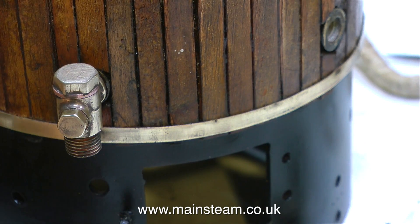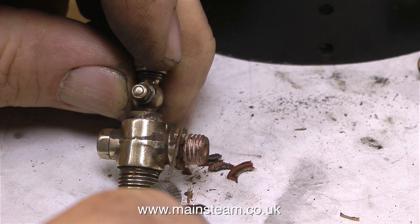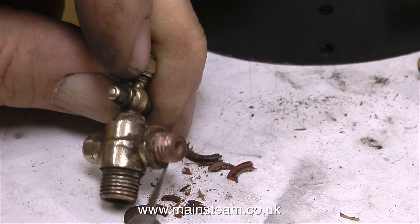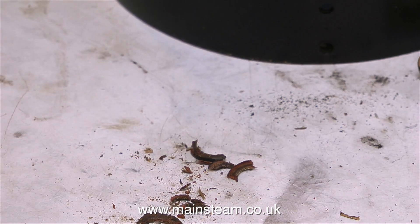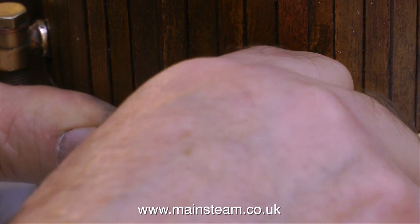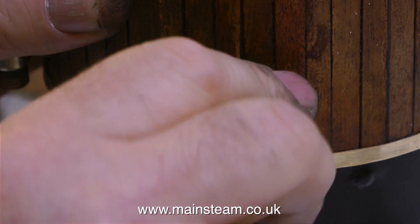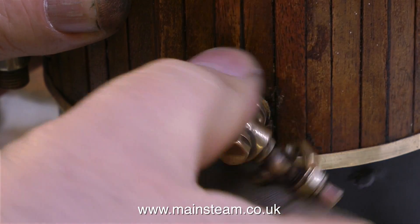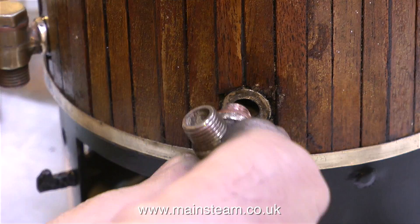The other thing, which is probably worse, is you could strip the threads in the boiler bush. This fitting had a fibre washer fitted. I don't personally like fibre washers, but it's down to individual choice. Using fibre washers can be a good idea because you can tighten the fitting down on the washer and the fitting will compress it. Whereas with the copper washers that I use, they're not going to compress any time soon. There is another type called a crushable washer, but I'm not too thrilled with those either — you just tighten the fitting until it's in the right position and the washer crushes to accommodate this. My final word: I use shim washers and Loctite 542, and my fittings never seem to leak. I've always done it this way.